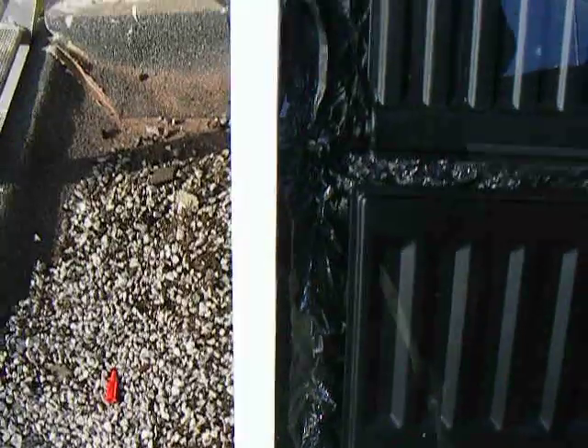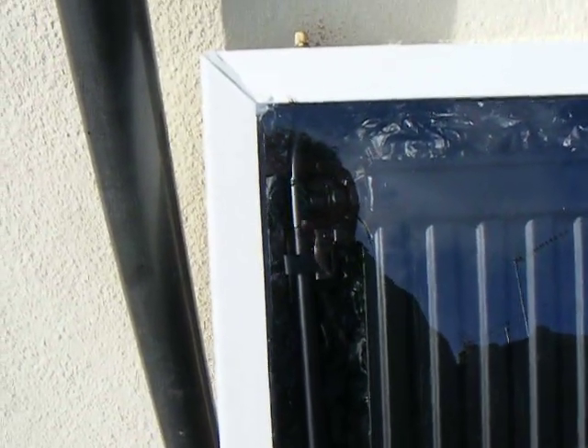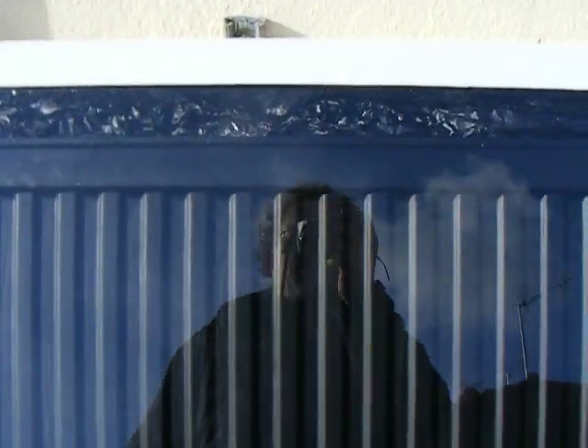The radiators I've painted black. The flow — probably can't see — comes up on this side because I've covered the edges in foil. There's 400mm of rock wool behind, squashed down behind the radiators. To cover that I've got some crinkly foil — I thought crinkly might bounce the heat around inside the box rather than bouncing it straight back — which I've spray-painted black.